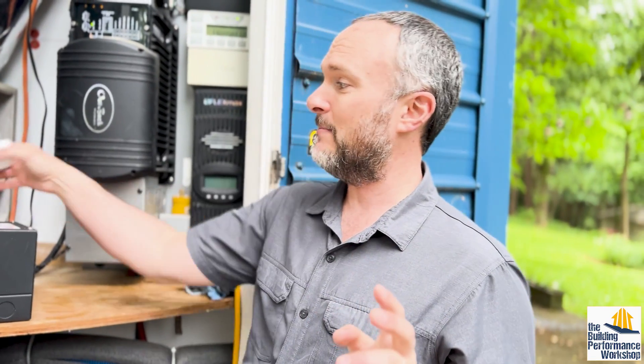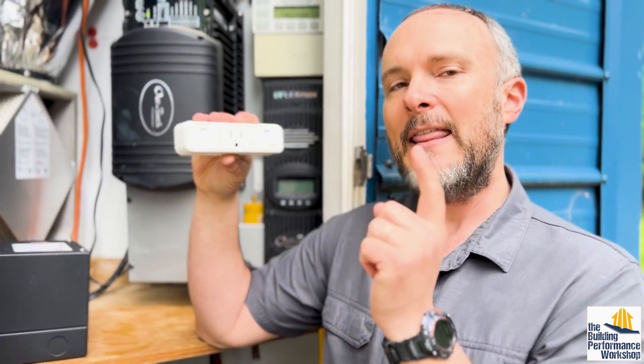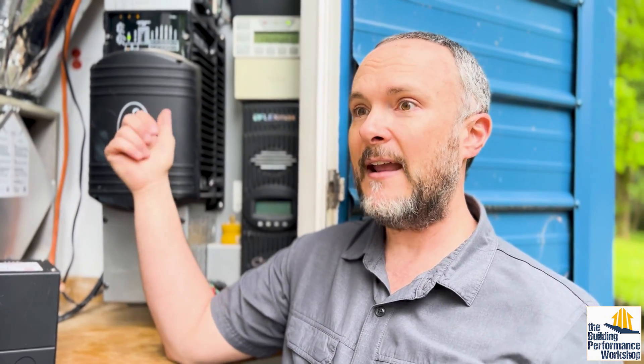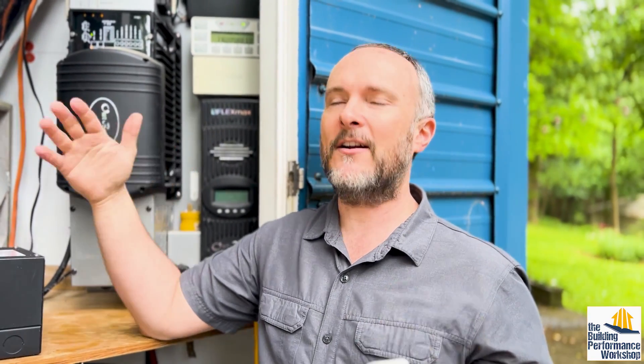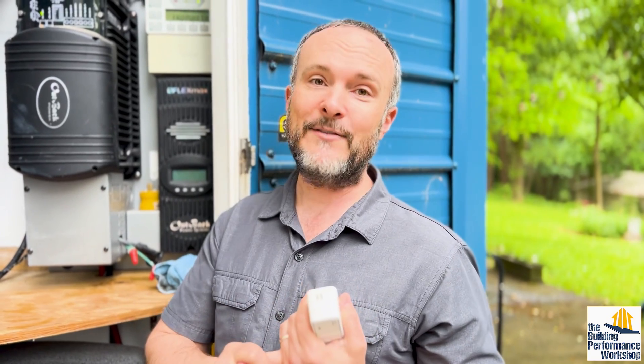Now that this is done, we can have the air inside the tiny house be constantly regulated. The last piece of this puzzle is the Broan Smart Plug. I'm going to plug the ERV into this, and then this will communicate with the indoor air quality monitor on the inside of the house, and that will say, hey, it's starting to be a little stale in here. That's a better scenario for this tiny house because we don't use it every day. Back when we lived in this every single day, keeping the thing running 24 hours a day made sense — we were taking showers in there, using the bathroom in there. Right now we don't take showers in there; in fact there's no water even in the water bag.